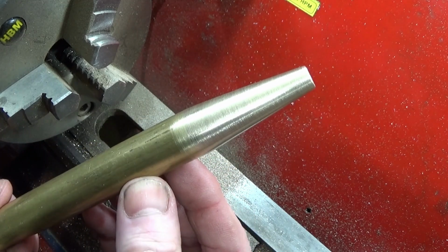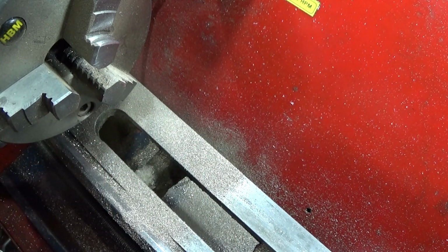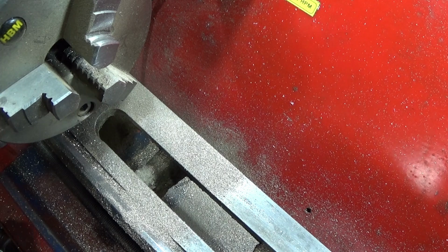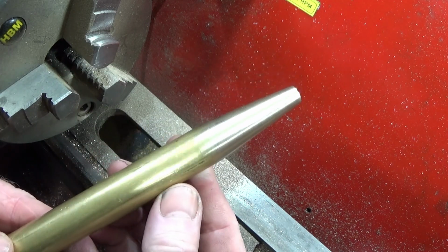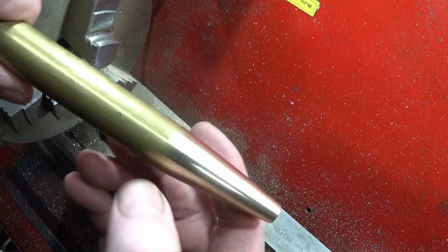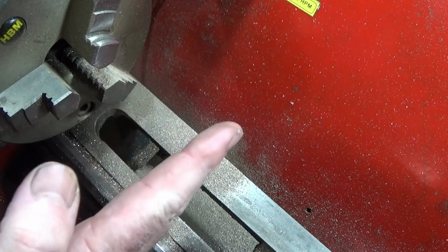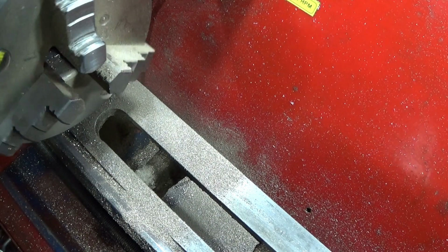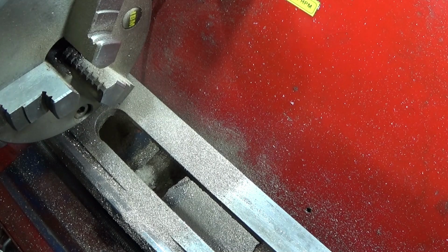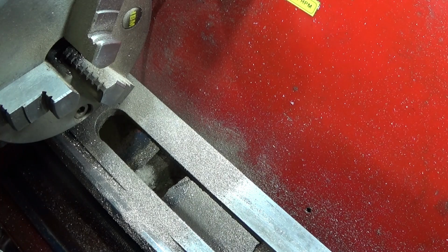That's the angle. If you want to play safer, you can actually use a collet chuck rather than the jaws, but as you saw in that clip there, I had the bar out quite a length, so I was away from the jaws there. But it's a great method of actually producing angles, deburring, and even getting good finishes on metal using files.